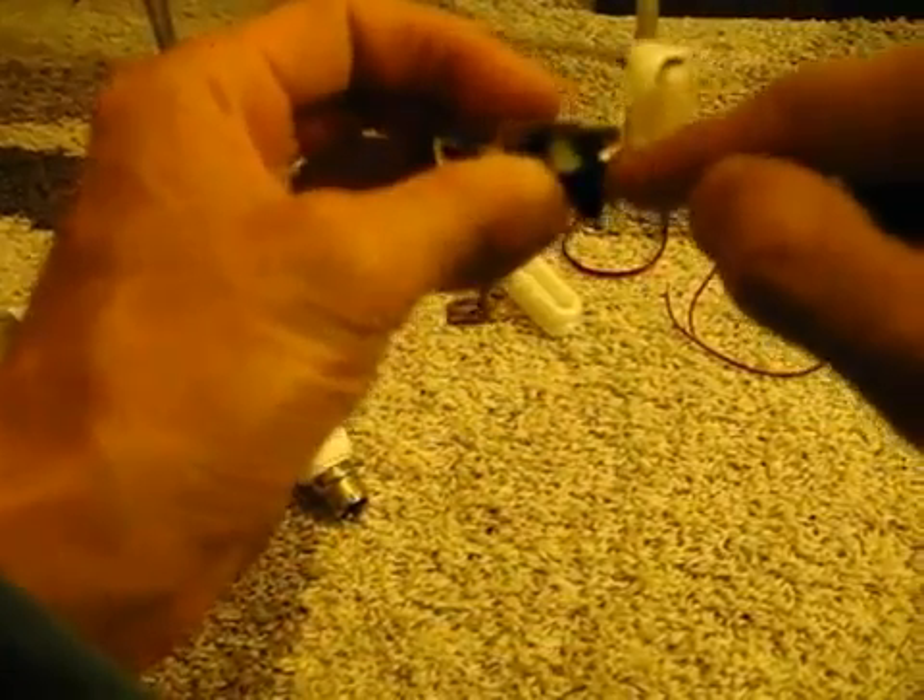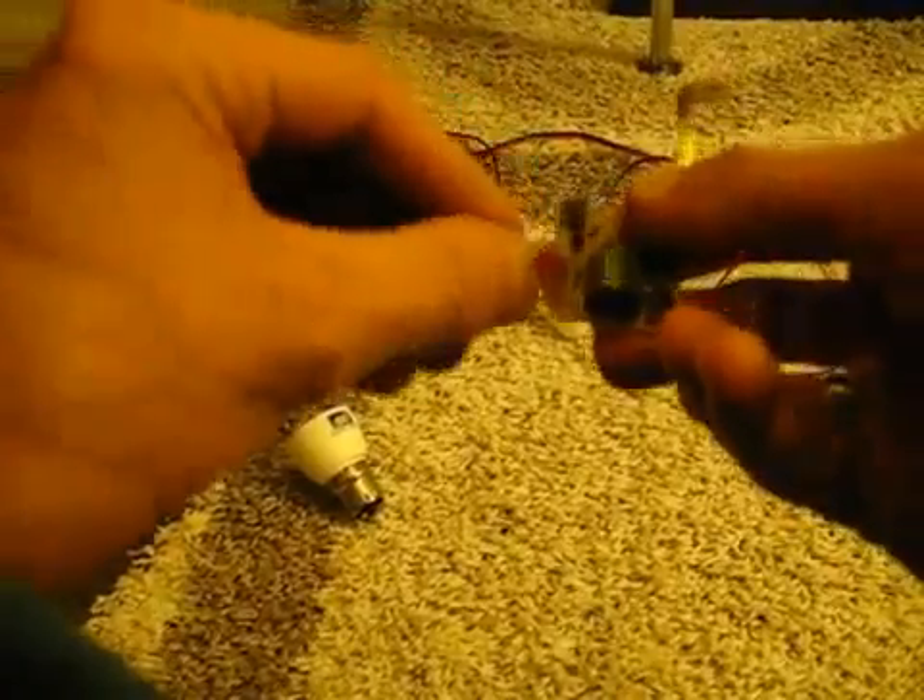The next thing to do is to remove the flash itself, which is safe to touch now it's been discharged, and this high-power transformer. To do that, just push this black transformer very gently and it comes away really easily. Once you've pulled that away, you can then just push the red light back, push that straight back, and then rock it and this will just snap off. It might take a bit of twisting about but it will snap off, as you can see. And there we go — throw that away, no longer needed.